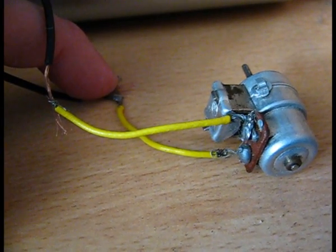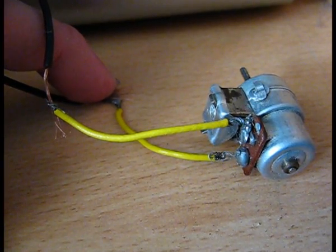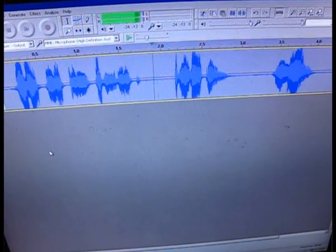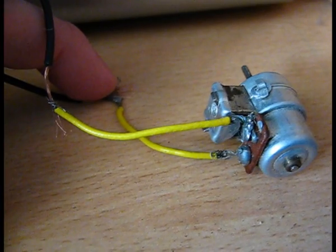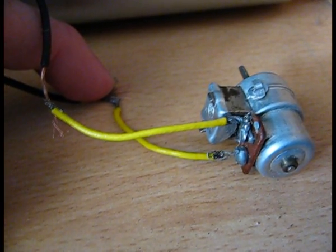And now I'm going to test an electric motor. This motor needs DC to spin, and the sound output is AC as it's the sound wave, which goes between positive and negative. So this motor is going to move backwards and forwards very slightly as the sound wave, and you should be able to hear some sound coming out of the motor.